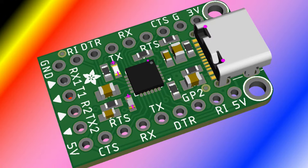It has two modem control signals and everything. The only thing I found later is that you can't use the LEDs in the middle, so I removed them because the modem signals were conflicting. But it does work — you get two COM ports. Expect more next week, lots ahead.